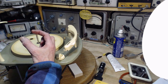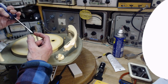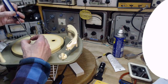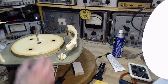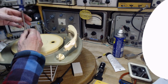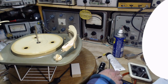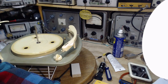So that's a split ring like this. And what I eventually did was I took a not terribly wide, but somewhat wide screwdriver. I was able to touch both ends of the loop, push it down, and push it kind of down into where the groove is, roughly. And then go right on the other side here with another screwdriver, pushing it down. Even though this side started opening a bit, this was wide enough to keep the ends in, and it popped right in, pop, just like that. It was actually really quite easy in the end. That's the technique that I used. Ooh, that's a mistake.